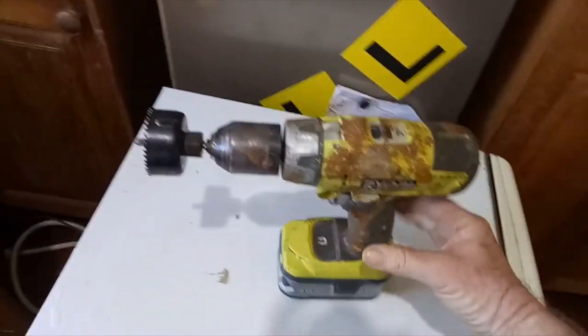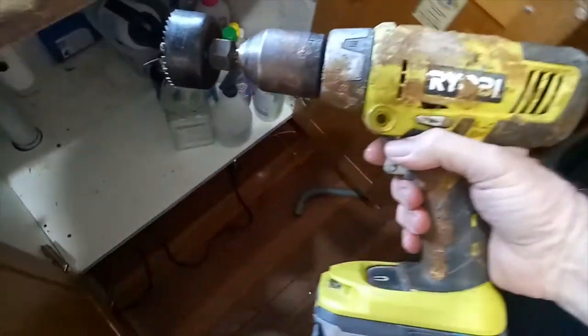All right, now I've got myself a 50 mil hole saw. It's 54 mil. I had to dig around for that. I'm going to cut it from inside the cabinet here because the way I see it, I want the jagged bits on the inside where you can't see it. So I'll cut it from here where it makes a neater hole. It really doesn't have to be that much bigger, just enough to fit that solenoid in. So I'm just going to start the cut right about here.